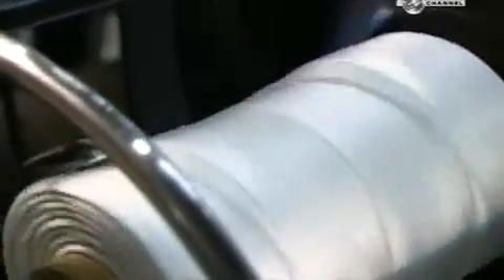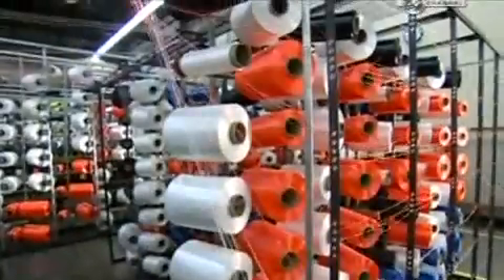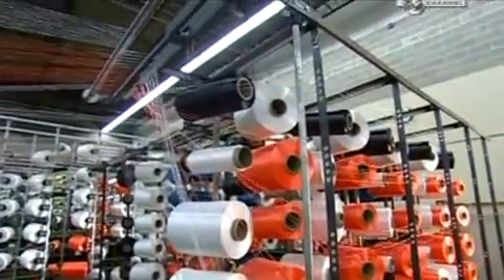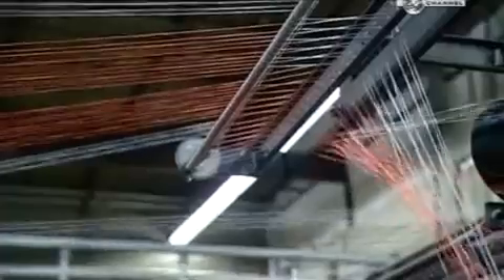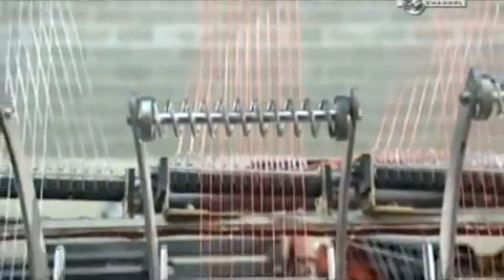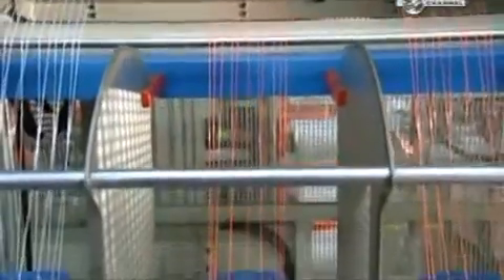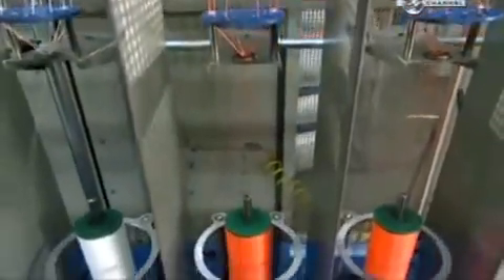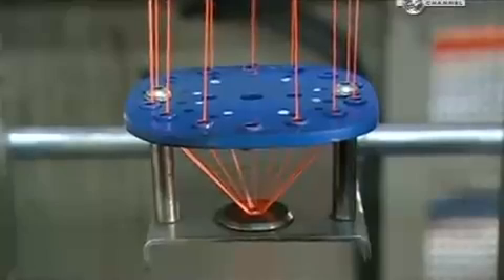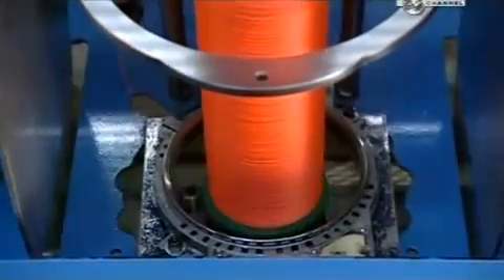This is core yarn, and it will be used to make other rope. Now, dozens of spools of nylon fibre unwind at the same time to make jackets to protect the core yarns. The fibres travel several metres over a network of rollers that act as guides and control tension on each individual fibre. They pass through distribution plates, as turning bobbins below twist the fibres into yarn. A platform moves up and down to evenly wind the yarn onto the bobbin.